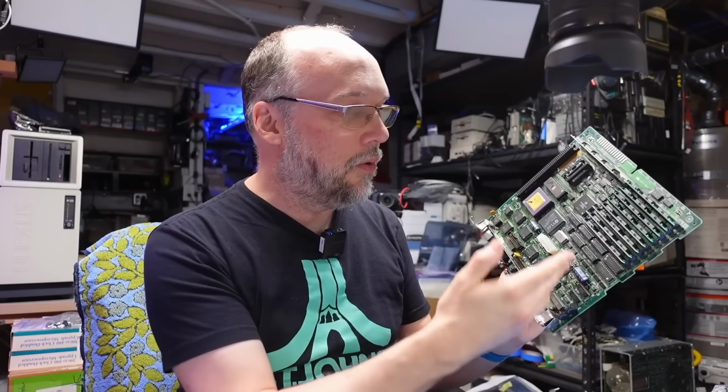And it would display any errors found on a little screen on the TechStep device, and it had a way to download reports off of the TechStep onto another working Mac where you could read a more detailed report of maybe what was wrong. Now, as far as I'm aware, this tool is very rare, and that's because even Apple dealers typically didn't do circuit level repair of a machine. So they didn't really need to know, oh, a particular chip was bad or something like that, because a dealer would never be doing that type of repair.